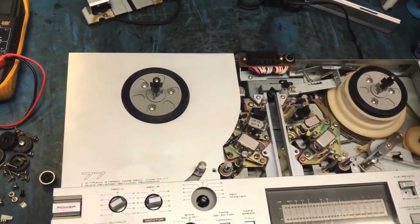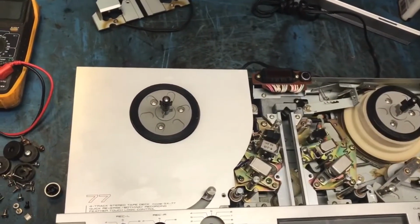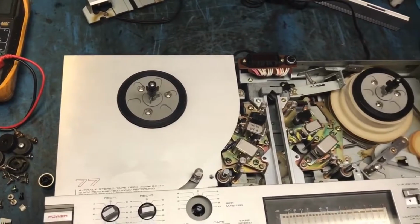Now, how do you clean it exactly? Well, you take it all apart, get these linkages up and get lacquer thinner under it and clean out the wax. Then re-oil it and reassemble it.